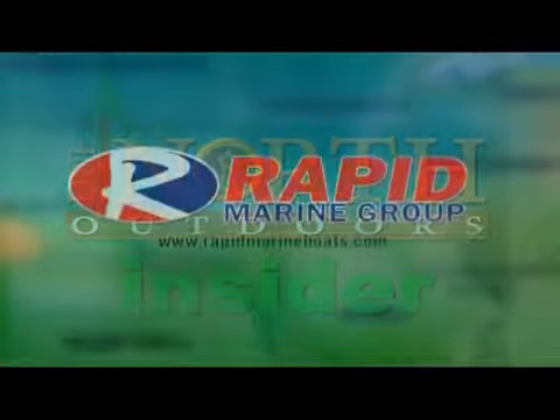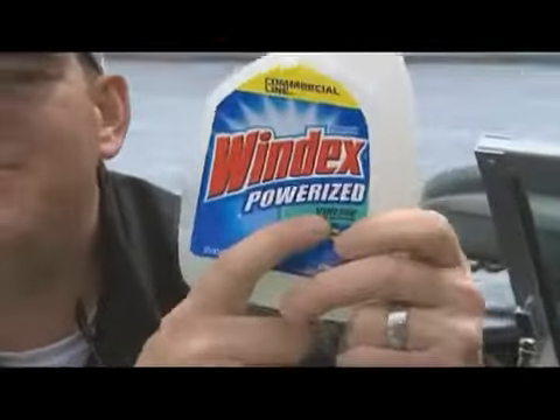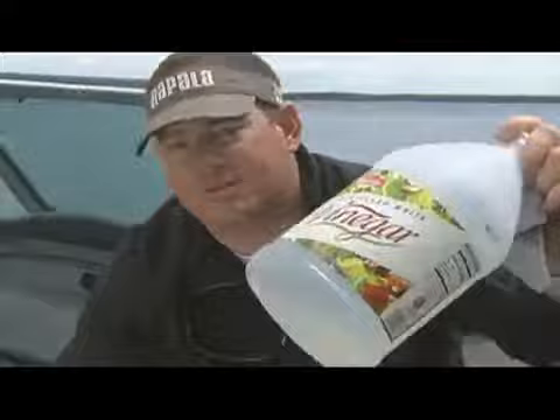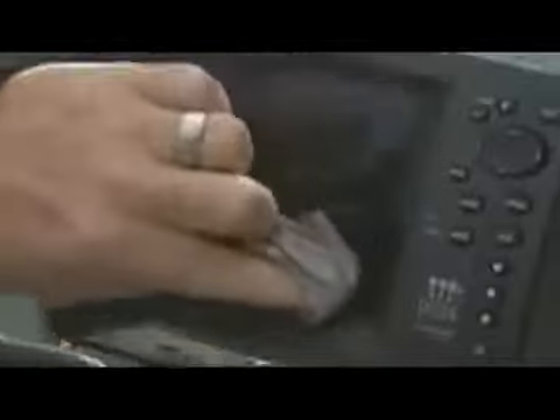Today's Due North Insider is presented by Rapid Marine. Hey there, Bill Shirk, the man about the woods. Fishing electronics have become a huge part of the fishing game, with a lot of the units costing over $2,000 a piece. They're high-tech and they work really well, but you can take care of them a right way and a wrong way. The big question I get is how do you clean the screen when you get all those little water spots on it? A lot of people just go for the Windex, but the key is to look for something with vinegar, not ammonia. Ammonia will actually take the protective coating off the screen. Mix a little vinegar with water and clean it. You've also got to use a lens towel — don't grab a paper towel, because paper towels will actually scratch your screen. Give it a little spray with that vinegar-based cleaner, give it a rub, water spots are gone, and your electronics look brand new.